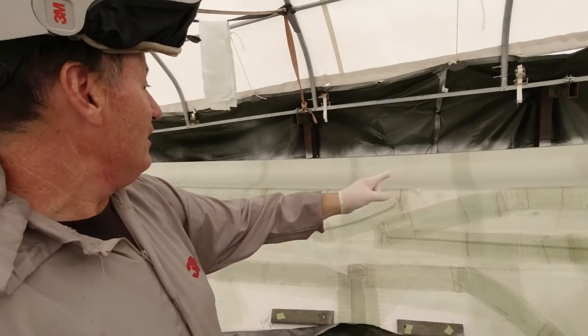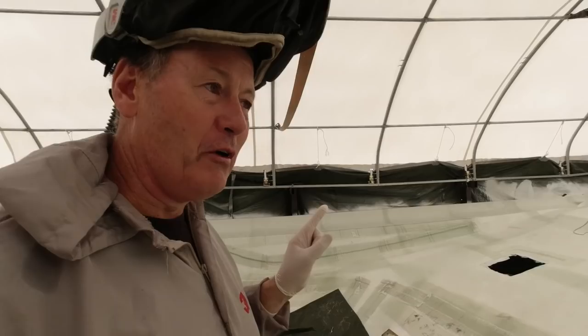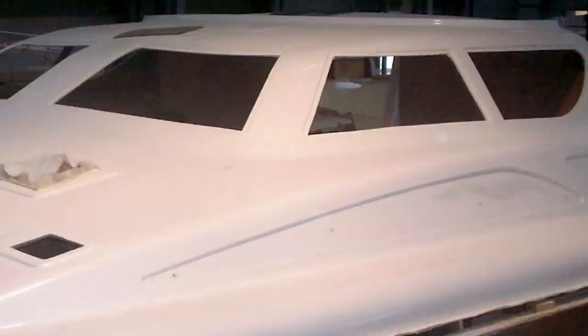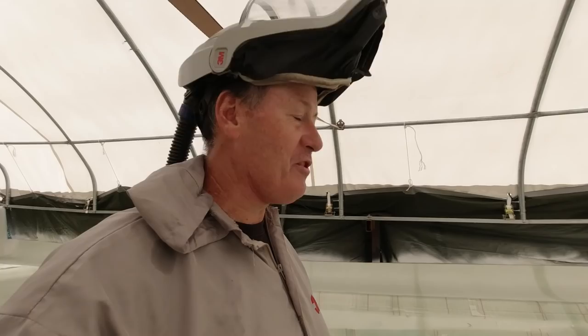All done — that's the side large port lights on the second level of the deck, now completely reinforced with two layers of 600 double bias. There's going to be a third layer on top, then foam, then another layer. I've taken the time to really concentrate on working these corners in so I've got minimal trouble and a perfect edge for my window to set into. That's been a pretty big job. Sunday afternoon now — I'd better get home.